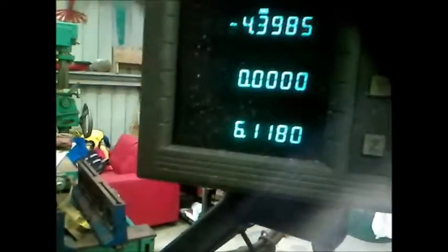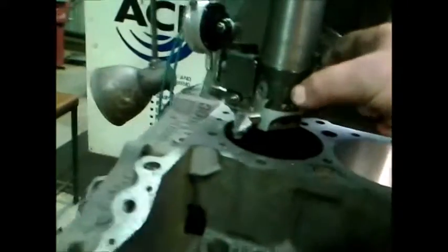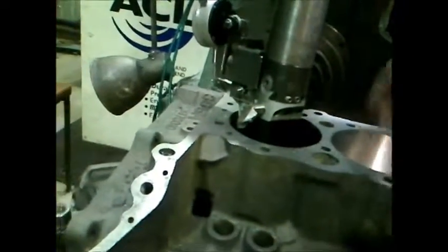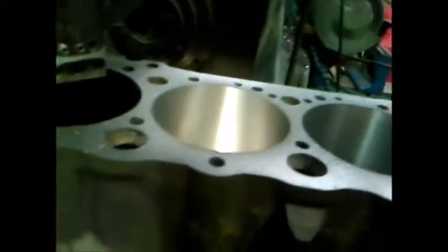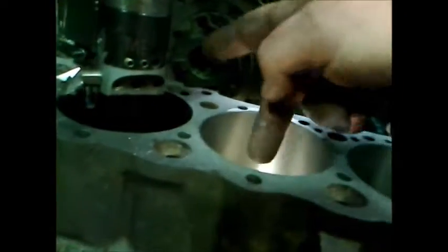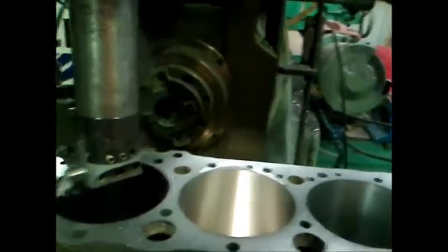Zero the DRO — that'll just tell us if something's moved. Now this is interesting: a Chev should be 4.4 inch centres, but I'm at 4.398 and a half, so I'm one and a half thou off the correct centre. That's because this has been bored before, no doubt in a production machine which would have an air float head and uses cat's paws — three or four little fingers that come out an equal distance on the spindle and centre the spindle in the block. But the reason you're boring the cylinder in the first place is because there's wear, and it's normally on the thrust side. So they're centring the block not in the centre of the original bore, but centring in the wear, so they can ensure they've got enough metal in their cut to clean up the wear.